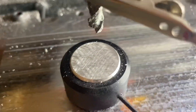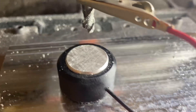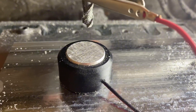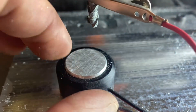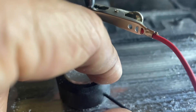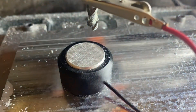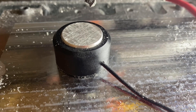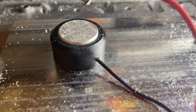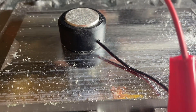When I go to set my Z height, I use this sensor, obviously. But I actually milled my spacer because it wasn't the same height from there to there. So I put it on the bed and made a nice smooth slow pass on it, and now I'm assured that it's always level and smooth — the same height.